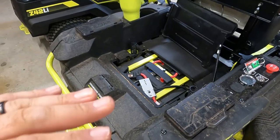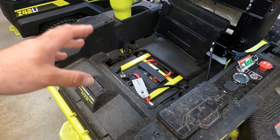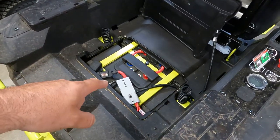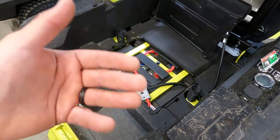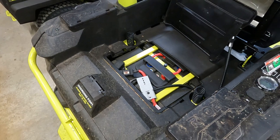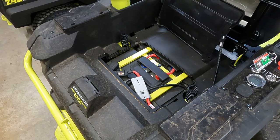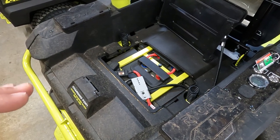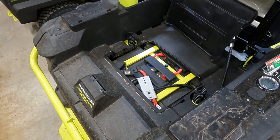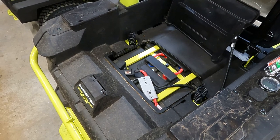Let's start with the biggest differences between these two, and that is the battery type. The 48 volt 100 amp Z-turn — the older one — actually comes with flooded lead acid batteries. These are typical batteries that have been proven over time, very strong, very reliable. One thing you need to know about flooded lead acid is that even though it has 100 amps, it's really only good for 50 amps, because after 50% depletion the batteries lose performance and really stop working.